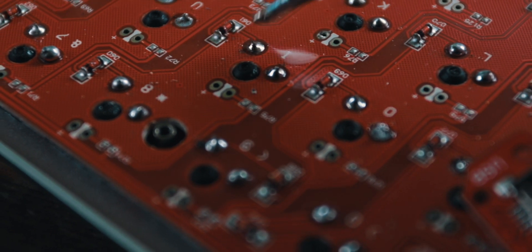When soldering keyboards — or anything really — your joints should look like a volcano. So let's go ahead and do this other one: again feeding it from the side, never touch your solder with your soldering iron directly, and just bring it off. After this, simply rinse and repeat. One thing you don't want to do is leave your soldering iron on too long — I'd say between three and five seconds. If you leave it on too long, you do run the risk of burning out your PCB, and I'll absolutely admit that I've done it before — I'm making this video so you don't have to.